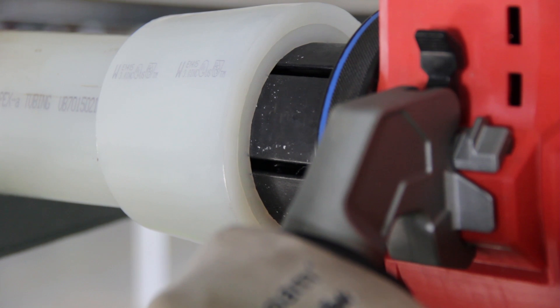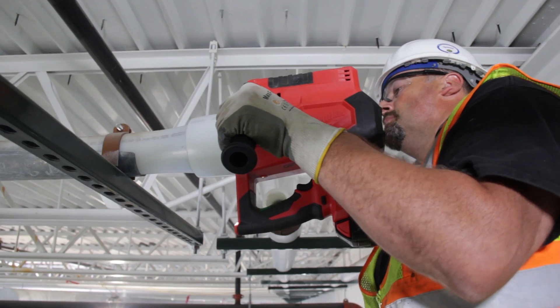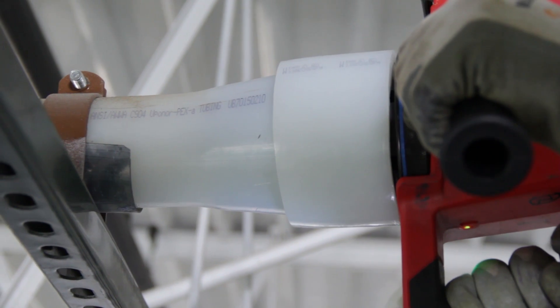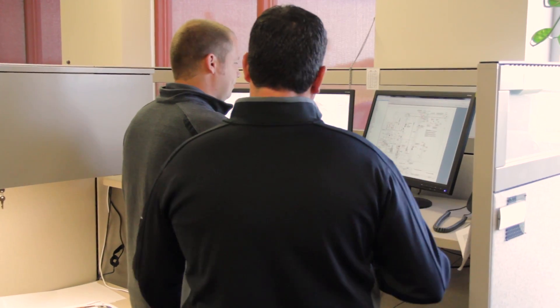You don't have to worry about sliding everything down. You can just adapt to the three inch mains now instead of having two different styles of pipe. The system itself — putting the fittings together, the lack of having to heat, weld, braze, solder, or thread the pipe — just the expansion and contraction of the Uponor pipe and the fitting system makes it much quicker, much easier, much more consistent on no leaks, air tests much easier, and it's just peace of mind of no leaks.